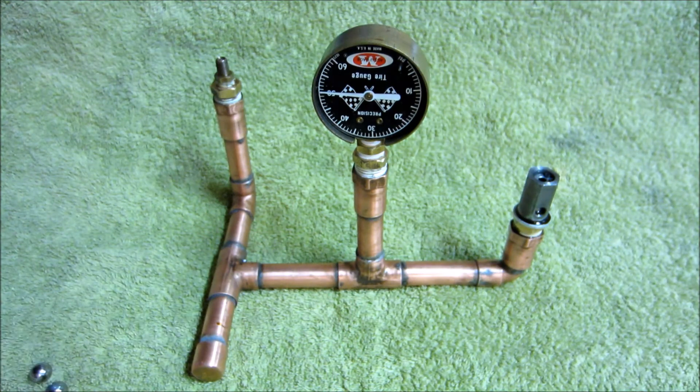You can see that it's holding about 50 psi. The manifold is filled with oil, so that represents 50 psi of oil pressure, and it's been holding that now for about an hour. The next thing I'm going to do is swap the gauge out for one that reads upwards of 100 psi at least, and I'm going to check and see what it pops off at.